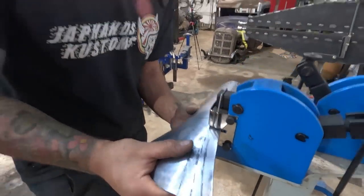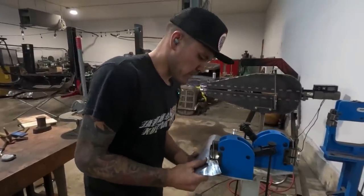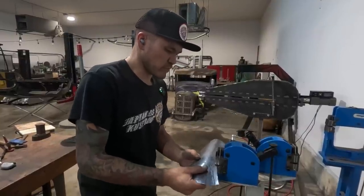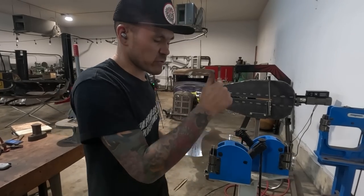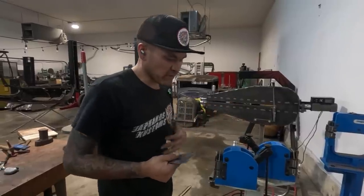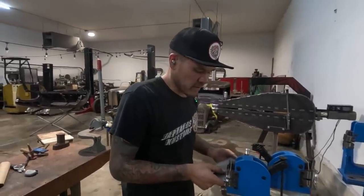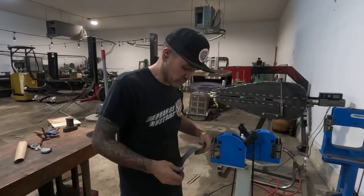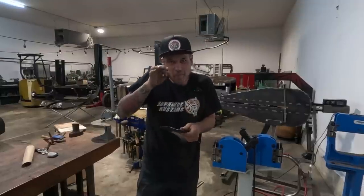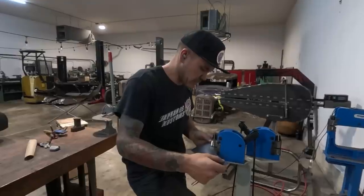People always ask me what tools are must-haves when you're trying to get into this type of work. If you're just doing your own projects in the garage, you can do a lot with hand tools, but an inexpensive shrinker stretcher is kind of a must-have. An inexpensive English wheel to smooth things out is important, as well as hammers and dollies. The shrinker stretcher really helps tune edges up, because otherwise you're trying to tuck a fork in the edge and hammer a little shrink into something, when you can get shrinkers relatively inexpensively, I'd say.